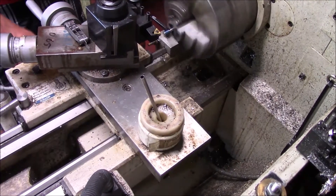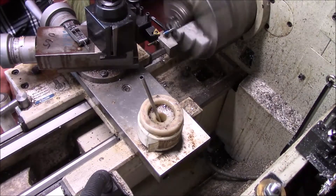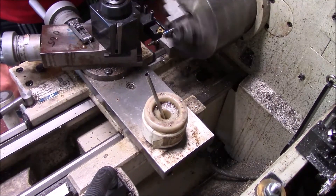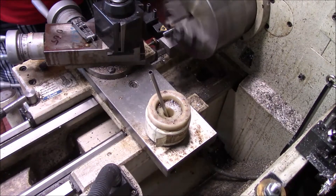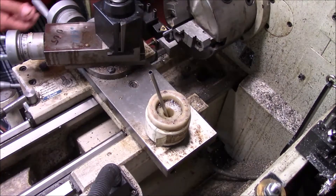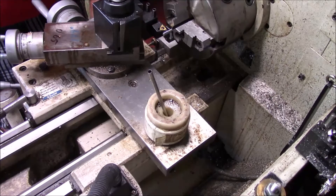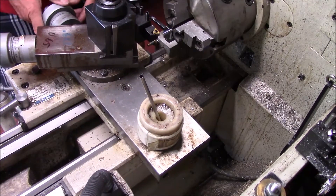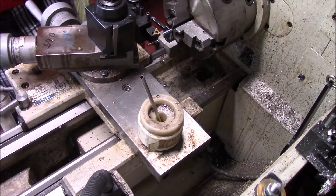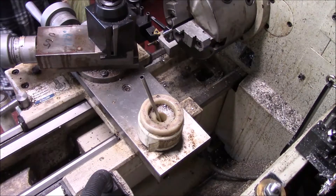These quarter-twenties — I will tell you, I'm not an expert threader. These are 20 pitch. I could theoretically go with any number, but I prefer to just pick one and go with it. We're going to check the threads, make sure we got a 20 pitch here. I've had a little better luck with the Bruce Weather method. With inserts, you want to cut a little bit on both sides, but don't go crazy. This is stainless, so I definitely won't cut much at the top.